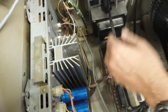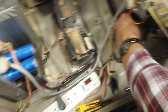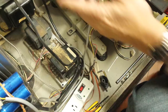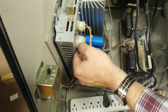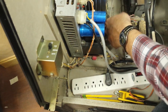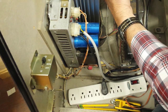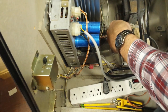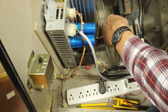Make sure your amplifier has AC going to your transformer for amplification, and make sure you have a volume control circuit properly hooked up. If you have a signal going in, amplification, and volume control, you should have sound. One other thing that could cause no sound: on the left side you have a mute plug and your output transformer. If the output transformer is disconnected — if the pink and purple wires are disconnected — you'll have no sound to your speakers.